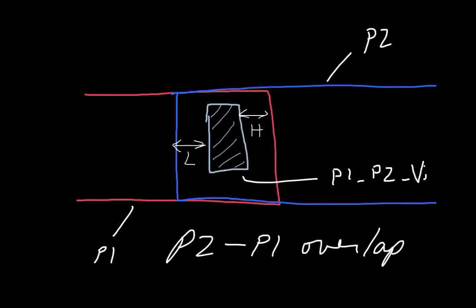In the middle of that double cantilever structure, where you overlap the poly two — the blue one — with the red poly one, you've got to have enough overlap of that via, that connection you're going to make between the two. So you're going to make a hole in oxide two, which is the oxide between the poly one and the poly two. You're going to make a hole in there — it has to be of a certain size or bigger. And then it has to be overlapped by both poly two and poly one. It has to land on the poly one — if you're too close to the edge, it'll miss it or part of it will miss it. And then you can also get some defects and stringers happening.